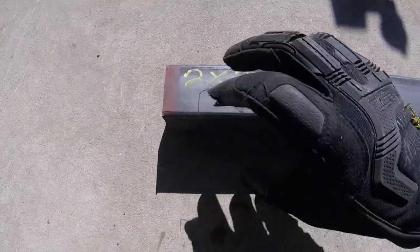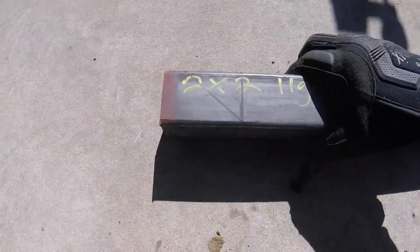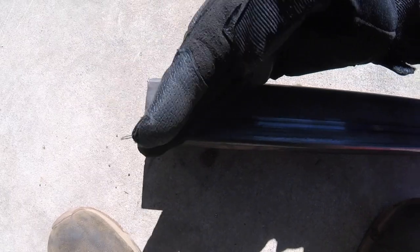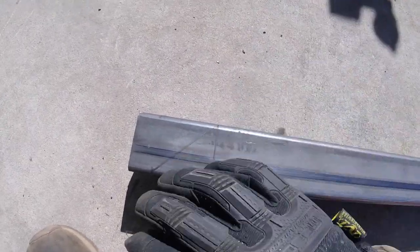And then that way, when I cut this plate out, this little taco, and then all the way across will be gone. And then this little taco will be gone. And then this piece can be bent and welded all the way around. One solid piece, and then just less cutting and welding. If I cut all this out, bend it, weld it, we're done.